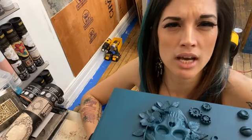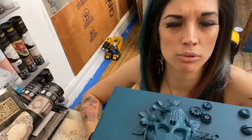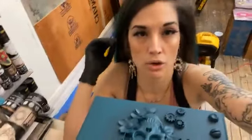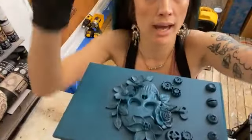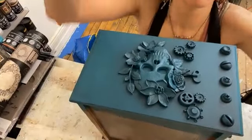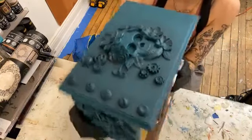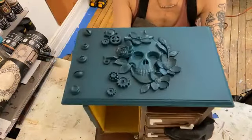Covered in a type of contact paper. Prime and paint, you don't want to primer paint over the contact paper. Get you some Goo Gone, girl. Let it soak and then chip away at it with a scraper. Okay, heat gun optional, but scraper, yes. Goo Gone, yes, or similar type citrus remover.